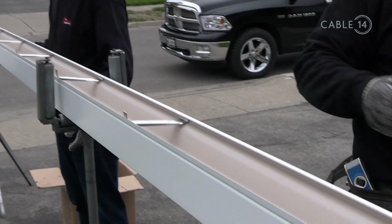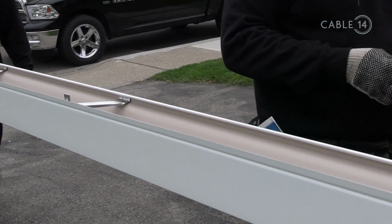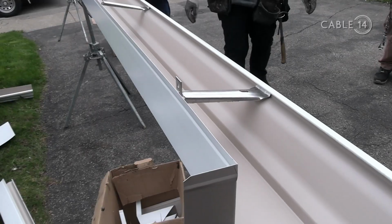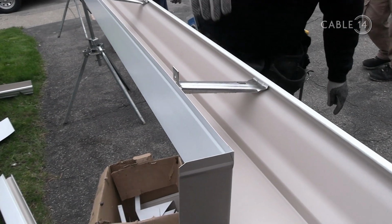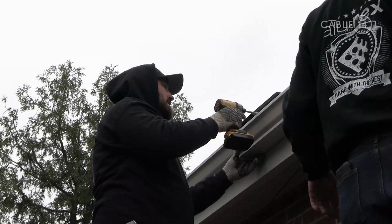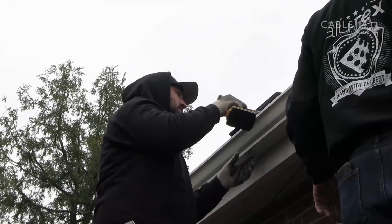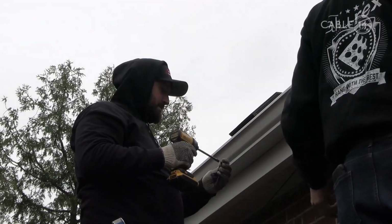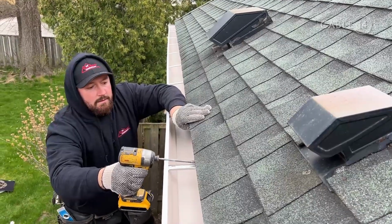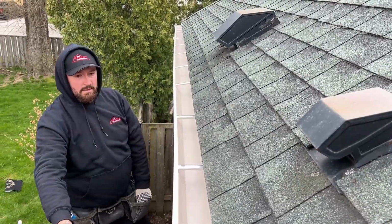You see, I don't do it often enough. Now, you were telling me earlier off camera about a job you saw where the clamps were, I believe, over 4 feet apart. Last year I saw a job where the spacing between the hangers was 4 feet. The widest I've ever seen was on a condominium corporation on the Hamilton Mountain, and they were spaced between 5 and 6 feet apart, which is way too far apart.